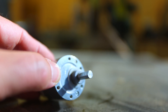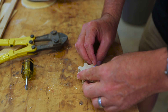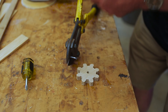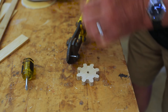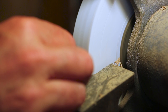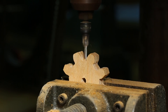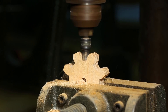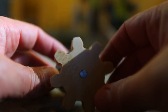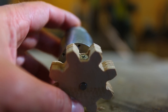On the motor I have, there's a little flat spot on the shaft — that's for a set screw to hold whatever pulley or gear you put on the shaft. So I tried to make a little set screw that would fit within the wooden gear. I took a regular pointed wood screw, cut off the end, then ground a flat spot on that end. That flat spot would press against the flat spot on the shaft and hold the gear in place and keep it from turning. I hid the screw in between the teeth on the wood gear — it just fits down in the space between the teeth. I slid it on, rotated it to the right spot, and put the screw in place. The screw had to be just the right length, which took some going back and forth on the grinder.